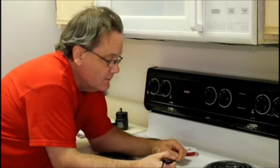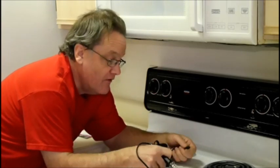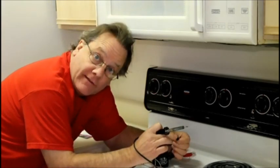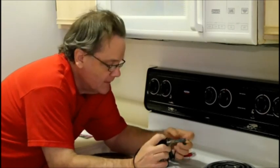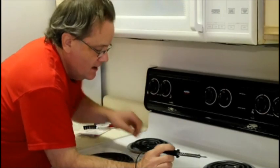Get your tin-lead solder and solder away. Of course, the soldering iron doesn't get this hot this fast — it takes a while. This is filmmaking; I want to be short. I've got my leads all tinned up and they should fit in here. Use a pair of pliers or something to squeeze the tin-lead solder to the right shape so that it fits in nicely into this hole. You might find wire that fits in nicely as well instead of tinning it up.